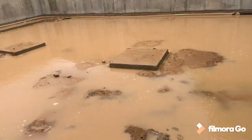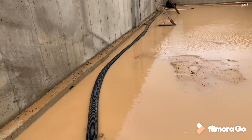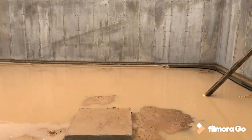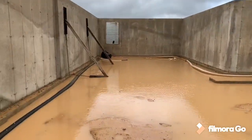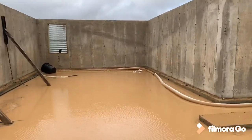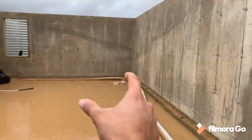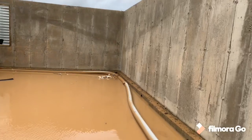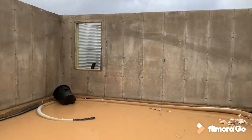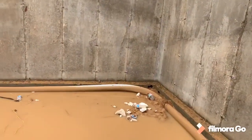There's another one. And then on either side of the foundation, inside and outside, we have one run of drain tile. So you can see that kind of chased around the outside. All that drain tile will get chased over. In this house specifically, we have a long skinny utility room that'll sit here, and we'll have the sump pit over in the corner. Right now I know they're showing it there, but that's not gonna work. It's actually gonna be over here.